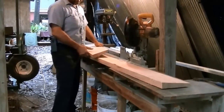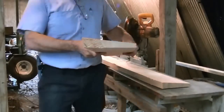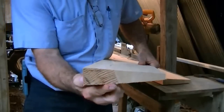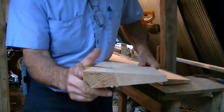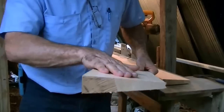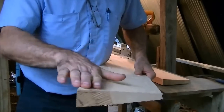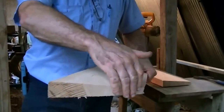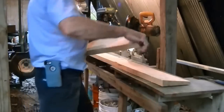We're ready to make our cut. It's critical that when you put it in your saw you keep the square side down. You can see this corner and this corner are square, but it's not square from the top to the side — this is at a taper. You always want that up so it lays flat on your table and you get the right angle when you join your two corners together.